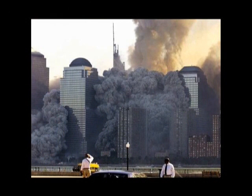What we see here is the spire. Looking at the second tower to collapse, there was a piece of core structure which was left after the remainder of the tower had collapsed. And again, if we do a similar dimensional analysis, looking at the relative size and the spacing of those remaining columns, we can tell that all of those columns came from column rows 7 and 8. Those columns were not accessible from the elevator shafts, and incidentally, were the weakest columns in the core.